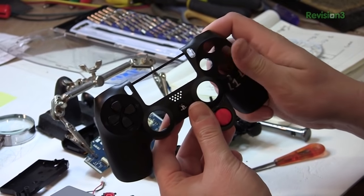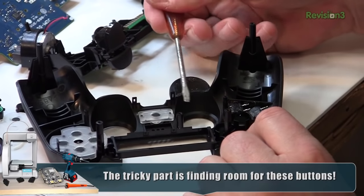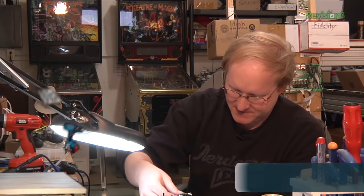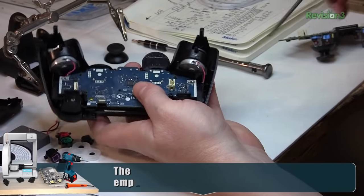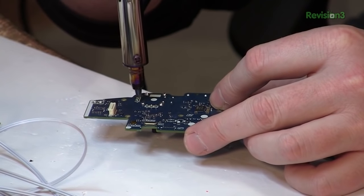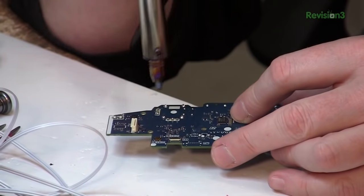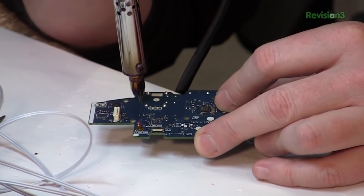I put some tack switches in here so my thumb can hit them. Inside, I had to remove some plastic for those to fit — it wasn't too difficult. I covered them with hot glue to secure them in place. I also shaved down this curved portion so the wires can get to the directional pad, and I had to make sure these switches were flat enough so when we put this in place, it doesn't impede it. We should be able to snake the wires up around this way and over here onto the circuit board. Going to remove the analog stick using the soldering iron I got from Element 14. I flowed this lead-free solder with some leaded solder, but I still need to let it heat up pretty good before I release the vacuum.